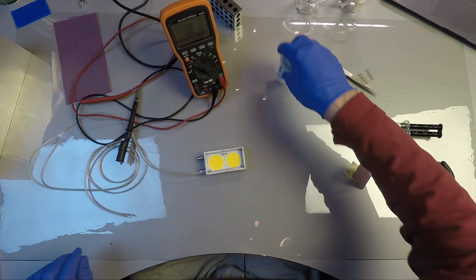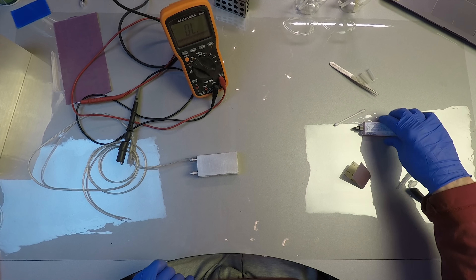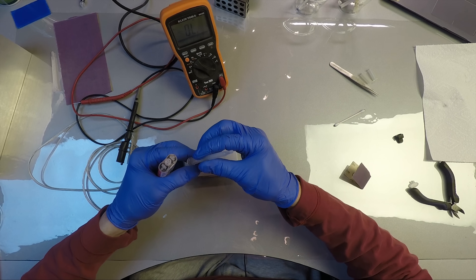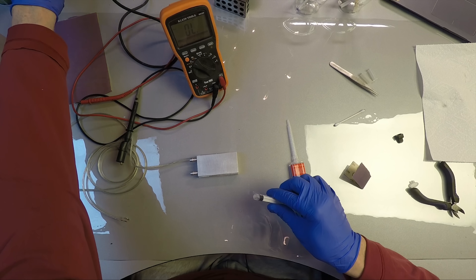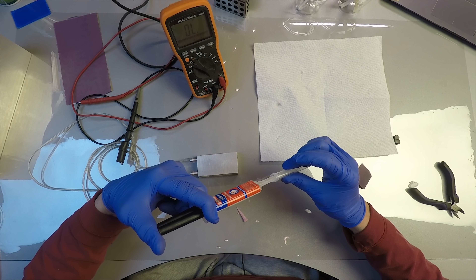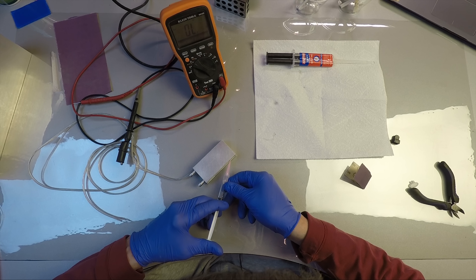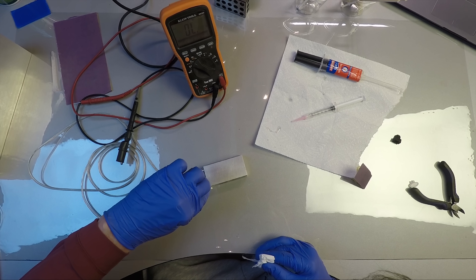Then what we're going to do is turn this over and reinforce this glue joint. We're going to take the epoxy I had here before — this time I'm going to use the mixing nozzle because it will make it a little more convenient to get the epoxy into a more selective syringe. We'll put a little glob of epoxy in the end of the syringe and just run a little bead along here. This will help seal it and also provide a little more strength to the bond between the side and the block.